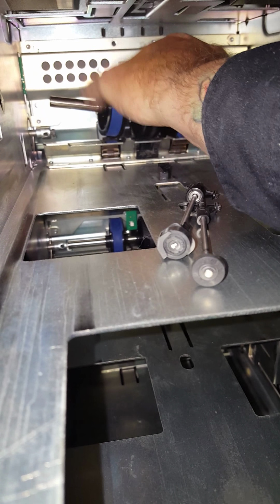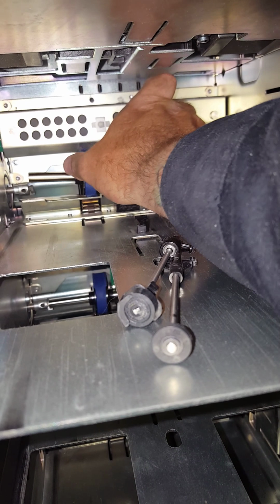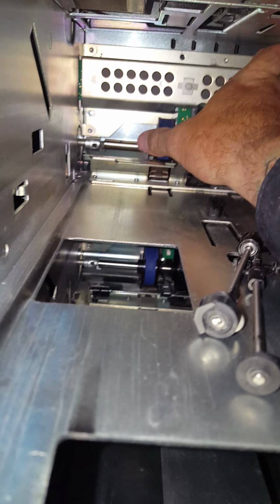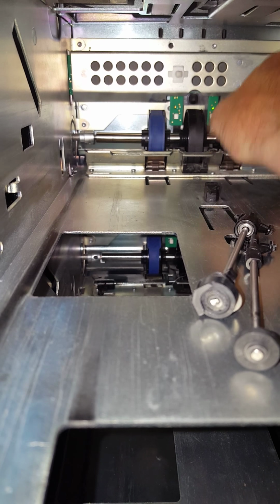And then putting it back in, there's a hole. I don't know if I'm getting it on the video, but anyway, there's a bearing over here. And you just stick the end of it inside the hole in that bearing. Make sure that you have your notch down. So now my notch is down, then put your pressure to the right so it'll slide in there, and just set it over the notch and kind of rotate it till it falls in.